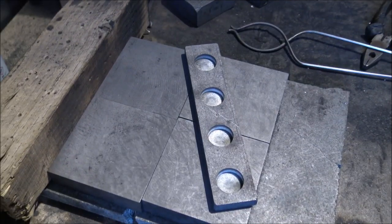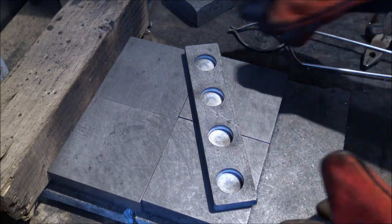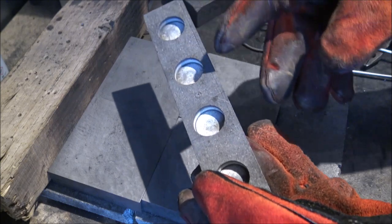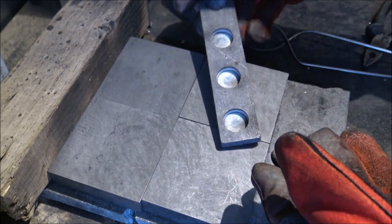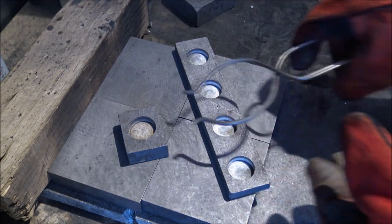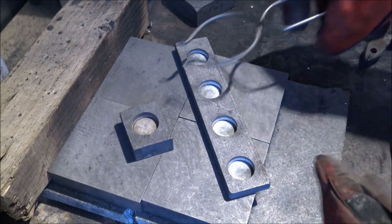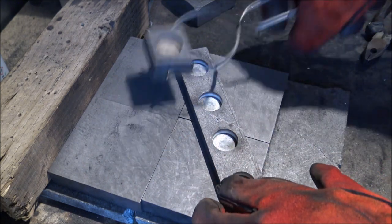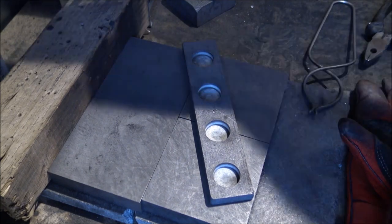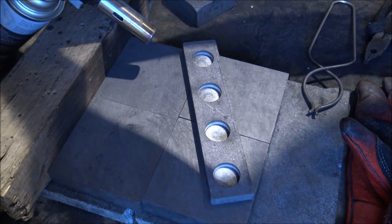We are now over at the silver pouring bench, and I'm doing this as a voiceover from a pre-recorded session of video, so I'm not pouring and talking live. These one-ounce rounds are a little bit different to regular bars, and because of how many we are going to make, it made sense to have a four-part mould made up instead of just using one single mould where you'd have to tip it out after every single one. The method by which I pour my silver is by eye, and as such we do not always get exactly one ounce in each cavity of this mould.